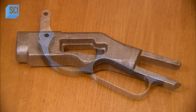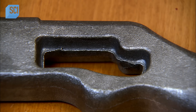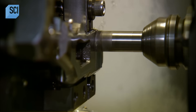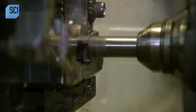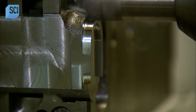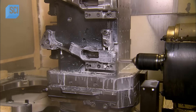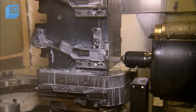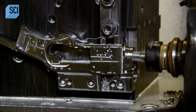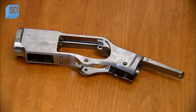The mechanical section of the rifle is called the action. Like the lever, it's forged out of a steel bar. Then, over the course of an hour, it is machined to specifications by 100 different computer-guided tools. This operation not only finalizes the action's external shape, it also hollows out areas for the internal components — namely, the rifle's lever-activated loading and firing mechanism.